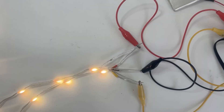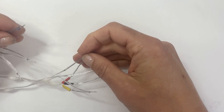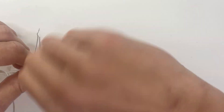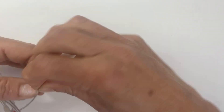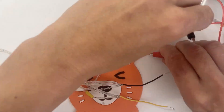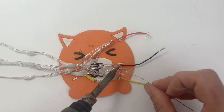Load up the test code from the tutorial on your Circuit Playground Express. On my strands the ground pin is in the middle, power is on the left — if you look close it's a reddish wire inside the silicone coating — and the data wire is on the right. First we need to find the in end of the strip; for me this was the end with the female connectors. Cut off the female connector, leaving some wire attached so you can use it for another project. Strip about a quarter inch of shielding off each wire and connect an alligator clip to each one. Power goes to V out, data goes to A1, and ground goes to ground. If the strip lights up, you've got it. Mark the wires so you remember which is which — this is important, as you're going to have a lot of bare wires during this project.